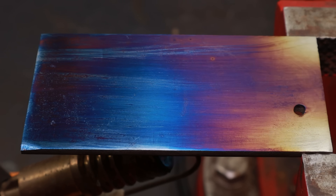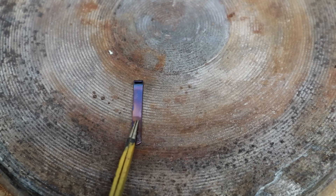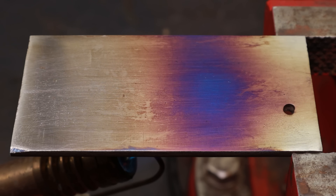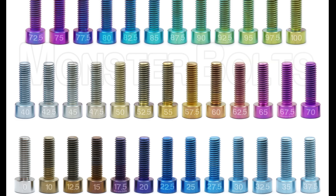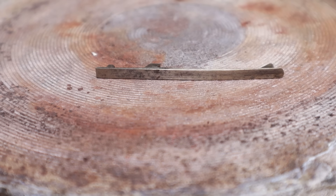Those colours are produced simply through iron oxidation, but if you look at a chemistry book, you'll see there is no blue iron oxide, and even though there's a yellow one, you can't really get a coating made out of it. The fancy colours we're going to recreate do not come from any substance, but instead from a physical phenomenon called thin film interference. If we get a thin film of oxide to form on steel — for example by heating it — in the reflected light you'll get specific colours highlighted depending on the thickness of the film. As the thickness increases from zero, you'll first see a light yellow, that progressively changes into a darker straw, before quickly turning to a deep purple and finally blue. These colours are also known as temper colours, since each colour corresponds to a specific temperature, allowing the metalsmith to tell when he's reached the temper he needs just by looking at the colour.